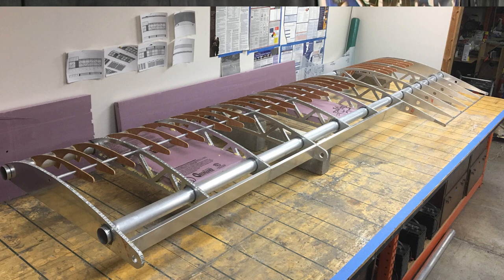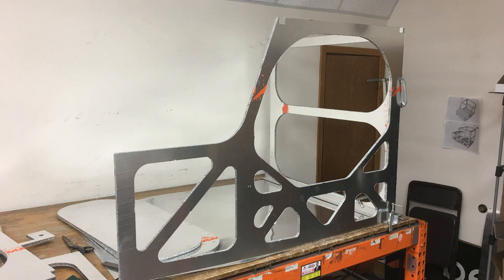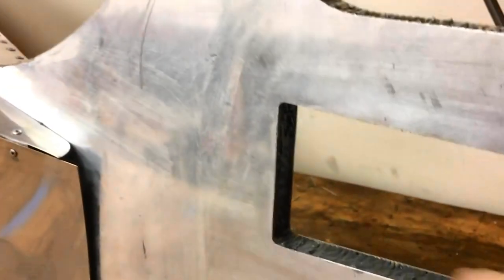So where is a component like this going to be used on the new airplane? We end up with a 35-pound wing that's just brute strong. We also use it as the entire structure of the cabin — a 29-pound cabin made out of honeycomb aluminum, so you'd be surrounded with this stuff. We use it for the formers on the rear fuselage: from a single four by four sheet I cut all the formers, put on stringers, put on skin metal, and it looks like any other metal rear fuselage. We're also using it to cut the vertical stabilizer and the rudder. The entire vertical stabilizer — which we loaded up over 300 pounds — weighs six pounds.